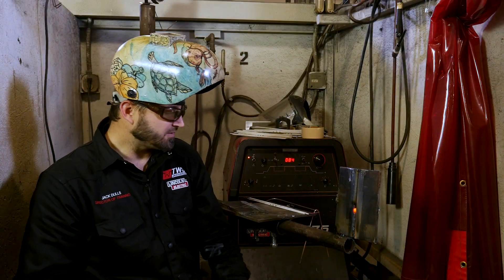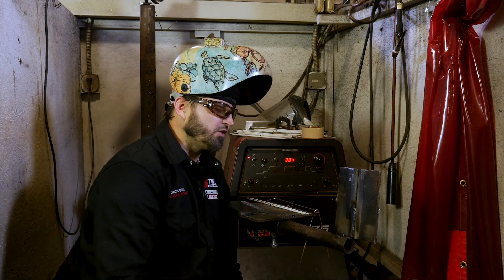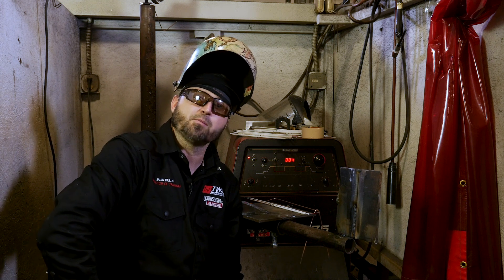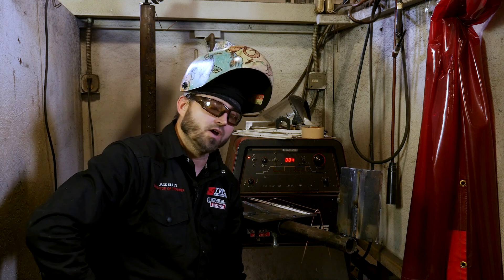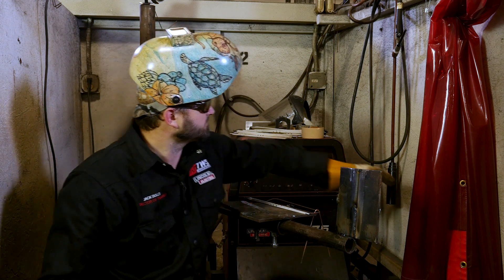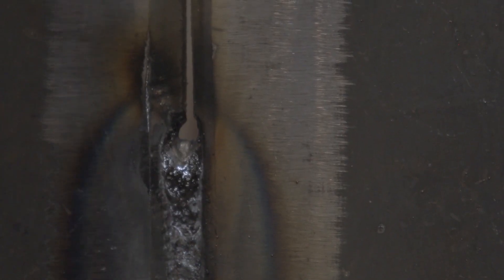We've got our root in there, and look how nice and tight it is in there. Look how it's not eating away all the bevels on the sides. I'm actually going to show you on this one as we get up towards the top — some of the don'ts, where you can see what happens whenever you long arc and whip it and flare it out, and you can see how bad it messes it up. I'll run another good pass, and then on the top portion, maybe an inch or so, I'll go ahead and mess it up just so you can see what it's like. So right now you should take your grinder and grind that down to make a nice clean tie-in, make a nice little boat ramp — slope it down so you can easily make a tie-in.